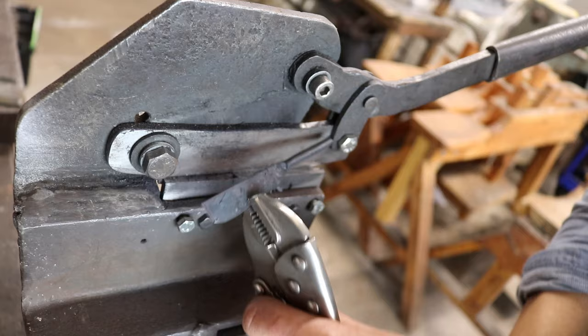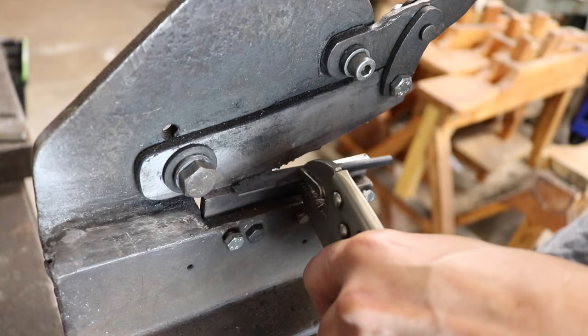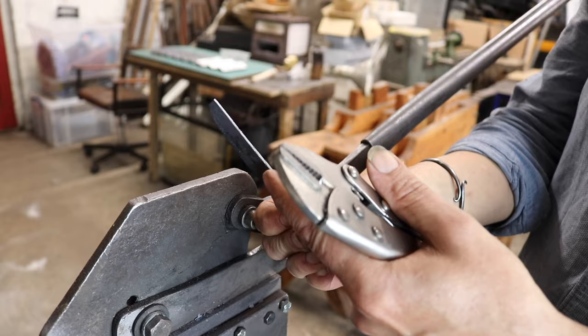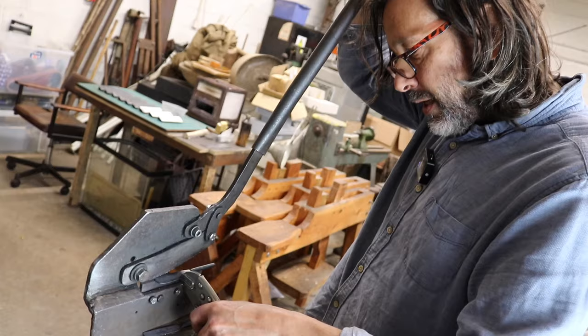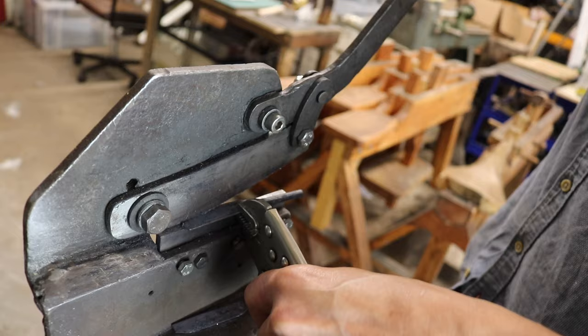And then I'll do some rough shaping here. I don't want to take too much off because it allows leeway for whoever's buying the blank. Something like that. And it will have distorted because it's been sheared, but we'll be hammering that straight and we can do that cold. So I'll just do one more at speed because I don't generally do stuff slowly. And another one, so it's a very quick process.